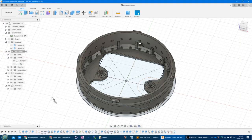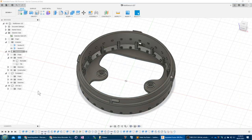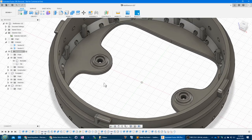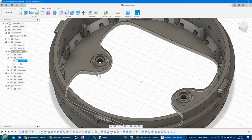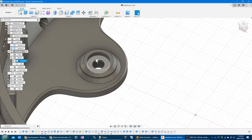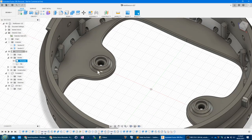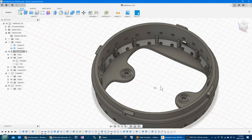So this is the back plate, and if I just turn this sketch off, we can see it more clearly. So the opening in the back plate is just so that you can coil a wire up in your back box. You've got that additional 45mm of depth sunk into the ceiling that you can actually use. So you can coil your Cat 6 up or whatever. The thickness of this box is 2.5mm, as in the thickness of the material is 2.5mm, which is not over the top, but quite decent. This height is over 2.5mm. It'll just give you a bit more meat to screw into. I'm not sure why I've double chamfered these instead of a single chamfer, but it just gives a lot of strength doing it that way.